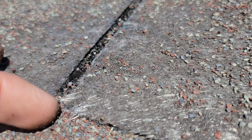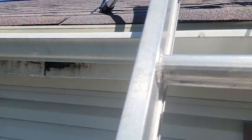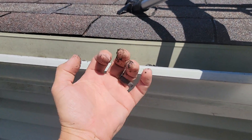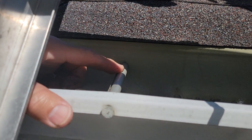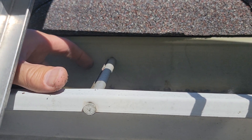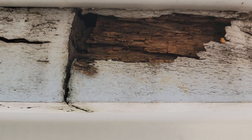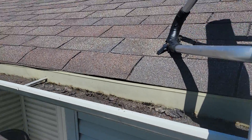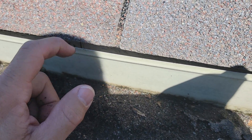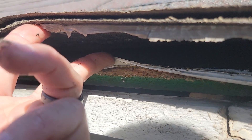You shouldn't see fiberglass this bad. Look at the gutter - it's dipping really low right here. It's been going on for a while because the excess weight of debris is just tugging on it. It's only held in by spikes. Check out the gutter guard here - I'm not a fan of spikes. Threaded hangers are better because they have threads that pull into the fascia board. Let's look at the fascia board - water's dumping in back here. We've got a larger repair bill now because it's starting to rot out. Water's getting in behind it, and part of it is actually completely missing the gutter and running right down the back. There's also no apron - nothing covering that.